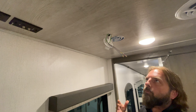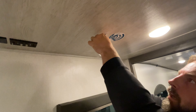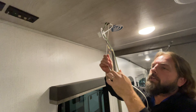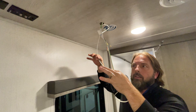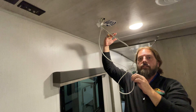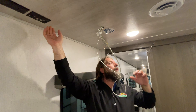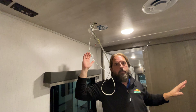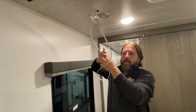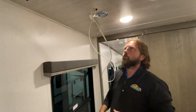You'd have to cut all the sealant, peel it up, and risk breaking it and possibly having to replace it. This other wire attached to it is just a loop of 12-volt power. You can keep pulling on it and won't find an end — they run it as a loop. This may actually be supplying power to the antenna and possibly to something like your key TV, a light switch, or something requiring constant power. So don't just cut this and hook your gateway to it, because the other side may be powering something else in the unit.